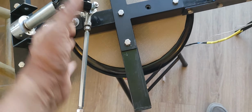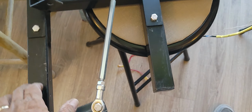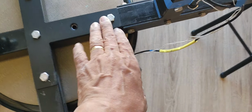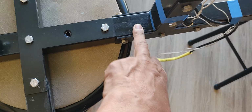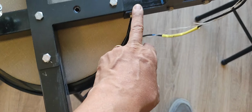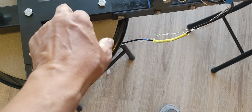Any type of connector that allows you to connect things fast is great. Even this stuff right here, even though it's not perforated, with the proper brackets. I found these brackets, which are excellent for this stuff. All you do is put the bracket where you want it, clamp it, and make sure it's nice and even in line with this square tubing. Mark the holes, punch the center of the hole, and drill, and you're done.